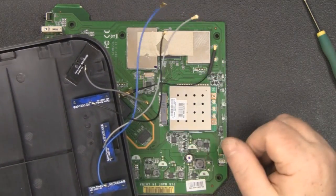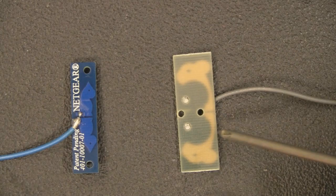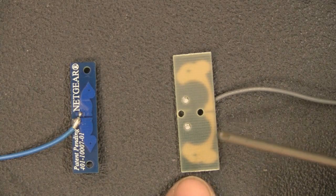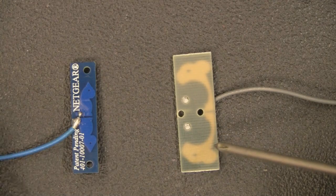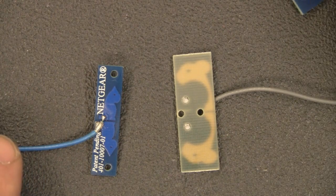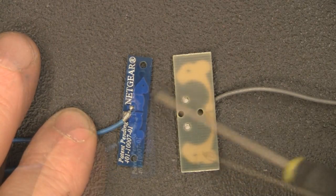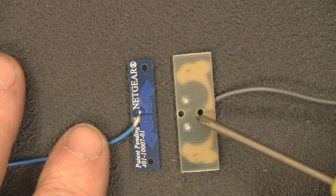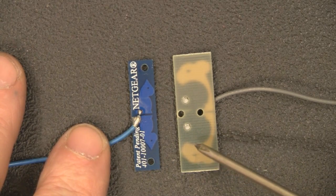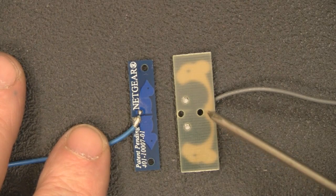Let's take a quick look at the PCB antennas inside this router, because a lot of the new innovation in antenna theory these days is in these small form factor PCB antennas. This one is the 2.4GHz antenna — it has quite an unusual shape with patent markings on the back — and this is the 5GHz one. The intricate shape actually produces a radiation pattern with more gain than you'd normally get for its size, and that's definitely where antenna design innovation is today.